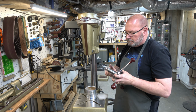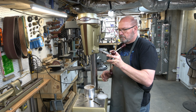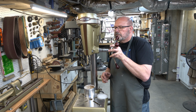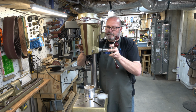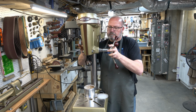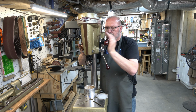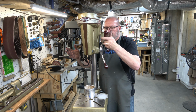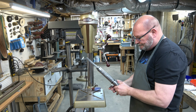And then we have the hub pinion spring assembly. And after we've lubed it up, we're going to go ahead and install it. And it is a real tight fit. This is the tightest pinion I've ever had in a drill press, but it moves freely. I may just have too much grease on there or something.